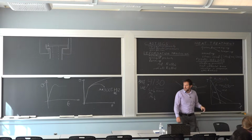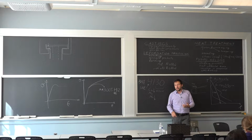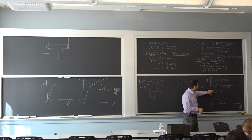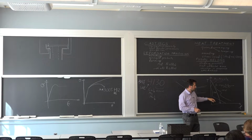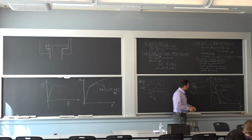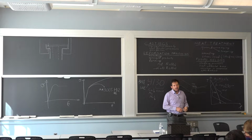if you take just carbon steel, if we forget about adding all of this, it's difficult to quench a carbon steel all the way through the core. And therefore, what we do is we add these alloying element that pushes the equilibrium transformation. Our goal, if we're going to do a quench of steel, is to avoid these equilibrium transformations. So by essentially removing some of the alloying element with the SAE grade, you're able to avoid forming the martensite during welding.